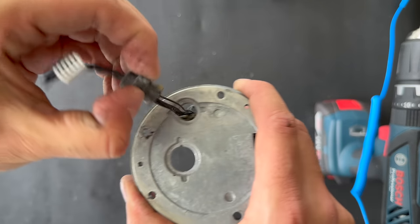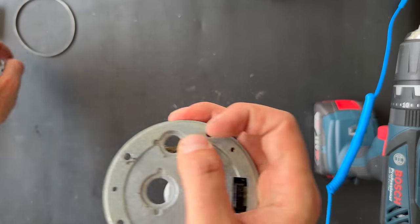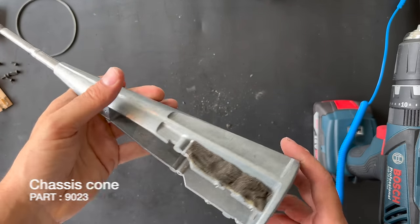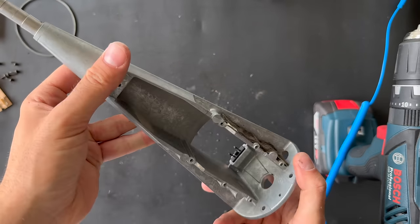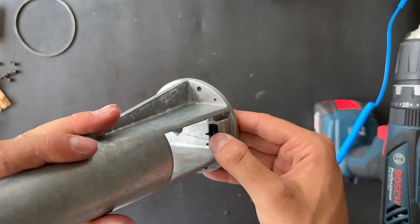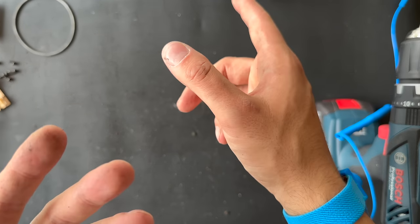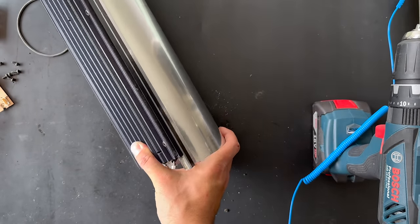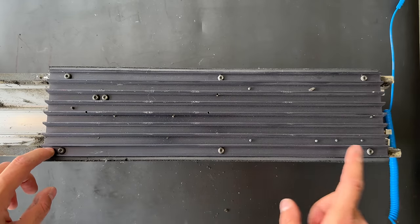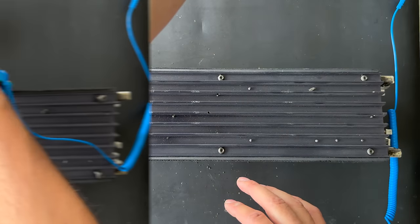Remove it and put it down. This is the cone — it's a big black aluminium piece, possibly also iron. There are also some clips we need to remove, but we're going to leave those. Next step will be removing the amplifier board. Here we have the amplifier board section — there are six screws we need to remove to take the heat sink off the big cabinet.